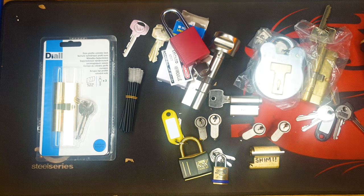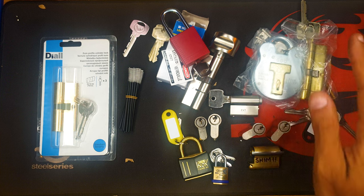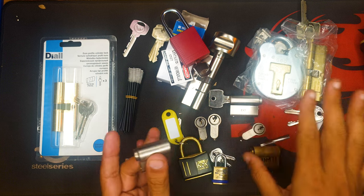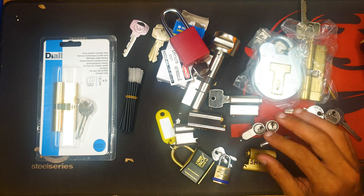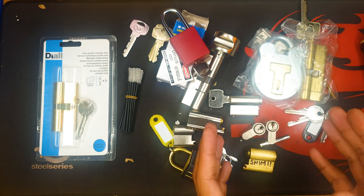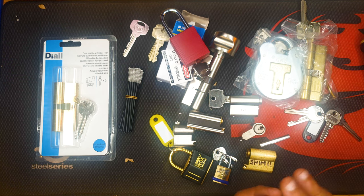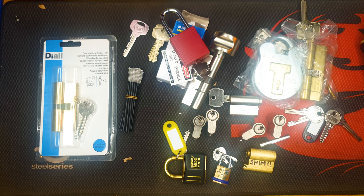I'm not the kind of guy who keeps locks in boxes. I like to put them in bags depending on security level — in different boxes. When I need them they're sealed so no dust gets inside. As for how I usually clean my used locks: I put everything in acetone for around 3 to 4 minutes, then get them out and dry them with air — acetone evaporates right away. Keep shaking and everything comes out clean as if from the factory. Then you add lubrication. Depending on where you live I can recommend some lubricant for you.